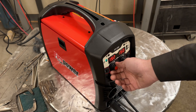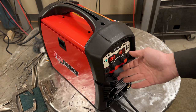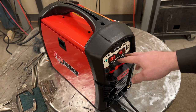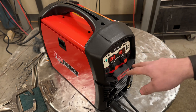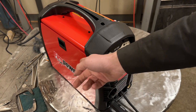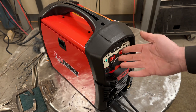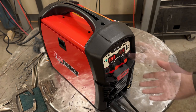It does have burn-back control — I'm not sure exactly how to access that setting, but it controls how much wire burns back to the tip when you're done welding, probably by increasing voltage momentarily when you release the trigger. Unlike cheap MIG welders that just have letter-and-number selector switches, this machine lets you adjust voltage and wire feed speed as actual parameters directly, which is good. I'll use the chart since I'm not experienced enough to have MIG settings memorized.